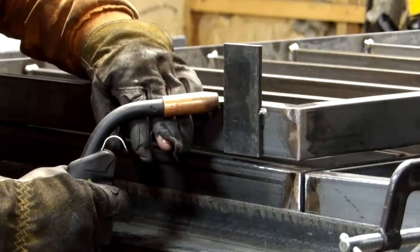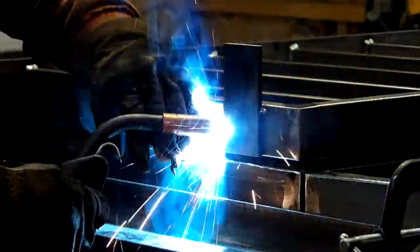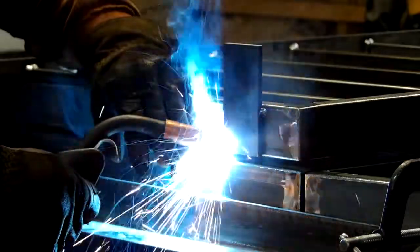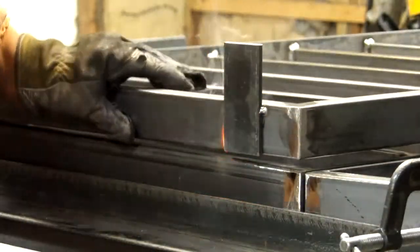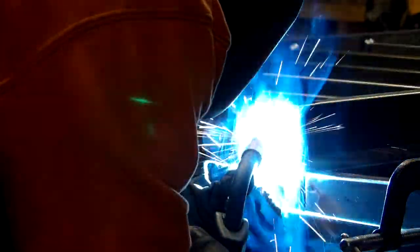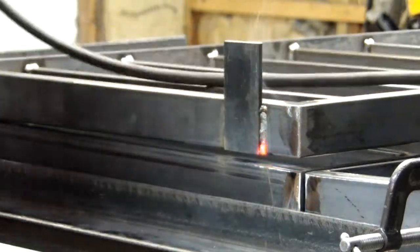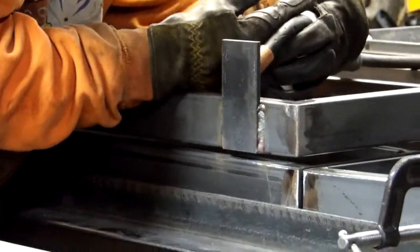Now right here you can see we've put some 2x1/4 flat bar, and we're using those as basically stops to go against the window frame. These are on the third panel. We'll have something similar for the middle panel to do a stopper, that way it doesn't cave in the middle. So JJ's just wrapping this up and getting this welded really quick, and he'll be done shortly.